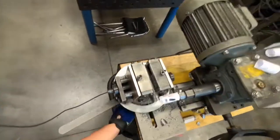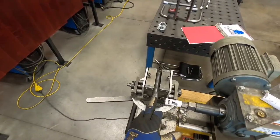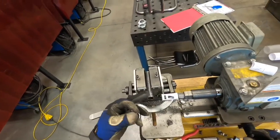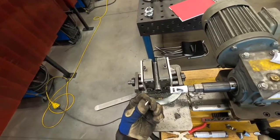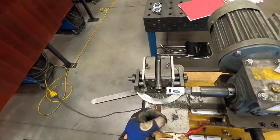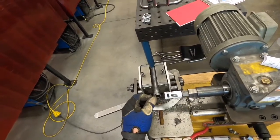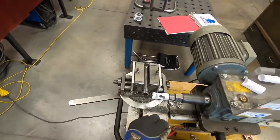We're still good. Now the safety with this is when we get about halfway through, it's going to have one of these pieces that's either going to fold over on the inside of the tube or it will fall out - it's not going to shoot out, but it'll fall out. These pieces are steel, and what I want you to do is pause and maybe even back up just slightly to allow this piece to fall out through these holes. That'll prevent it getting jammed up in your tube and deforming your tube. Then once that falls through, you'll go through and finish the cut.